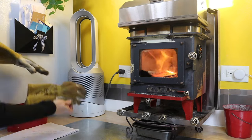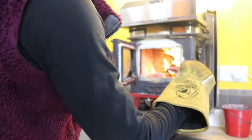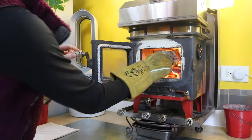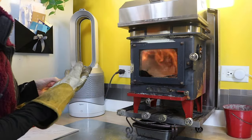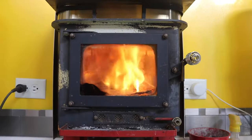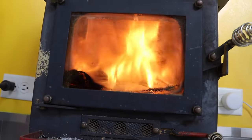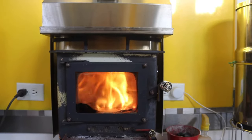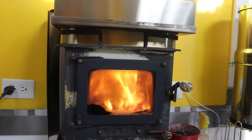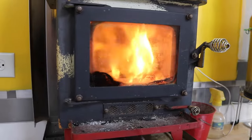There are a few things that make a wood stove a really key part of a tiny house. The wood stove puts out a super dry heat, and that's so important for living in a small space. In a normal bigger house in winter, many people run humidifiers to add humidity to the air. In a tiny house — or an RV, any small space — it's the complete opposite. Cooking, showering, breathing all constantly put moisture in the air, and because you're dealing with such a small volume of air it gets too humid. The temperature difference between cold air outside and warm air inside creates condensation on the walls. Before we had the wood stove it was actually a daily chore where I'd take a towel and walk around wiping down condensation — a very odd tiny house chore.